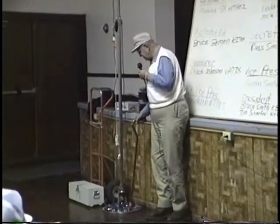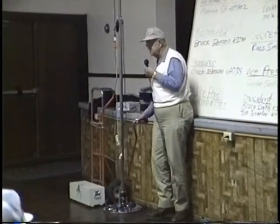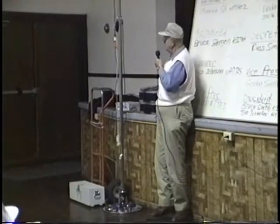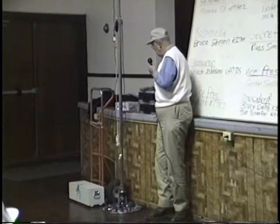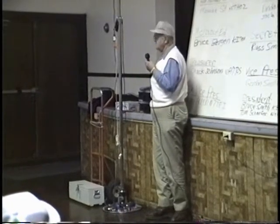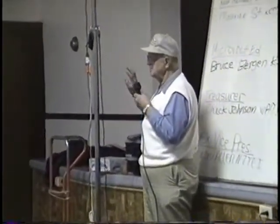Below the base plate, 16 ground radials extend out 15 feet, secured by bolts drilled into the bottom. Two of the three antennas were used at Field Day as phased verticals, configured by Tom Schaefer. The other antenna tried at Field Day — some kind of three-wire dipole — is not something Tom wants to discuss, though it did raise havoc with international broadcast frequencies on 40 meters.